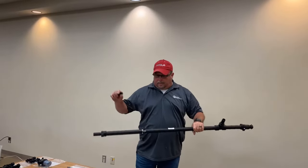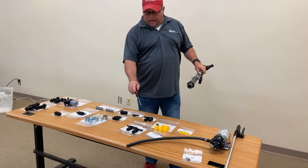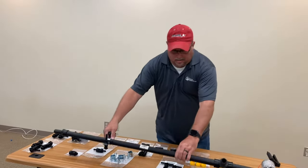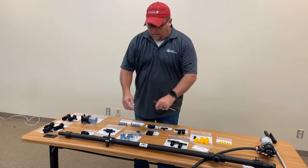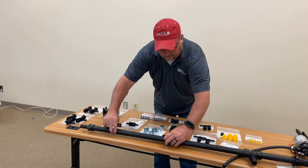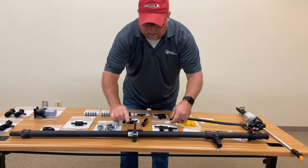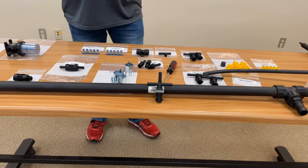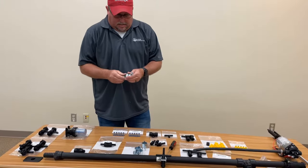So what I do is go based on your size of hose. Today we're going to use three-eighths. All of these part numbers are three-eighths inch hose that have the hose barbs on them, and this pump has a three-eighths inch hose on it. So you've got to have a way to feed it — this is the simplest, most inexpensive way to build one. You've got one nozzle body here in the middle that's going to feed the boom. I'm coming off my pump and going to stick my pump hose on there to feed the pipe and feed my boom. I'm just going to do a quick three-nozzle setup, which is about the simplest setup you can get.